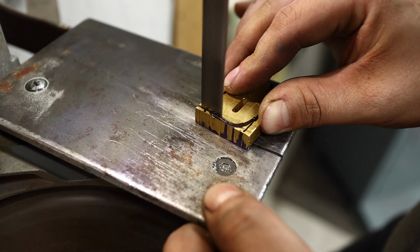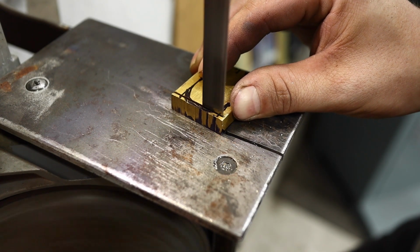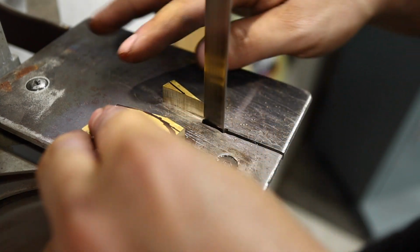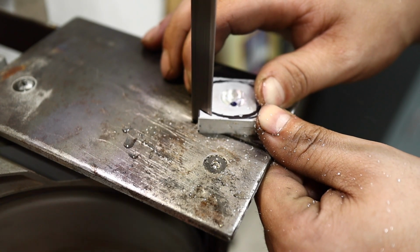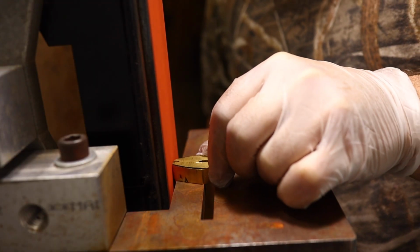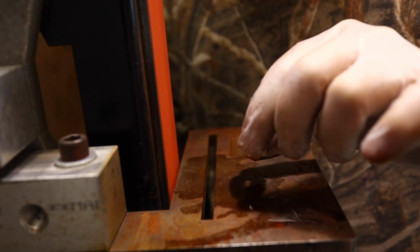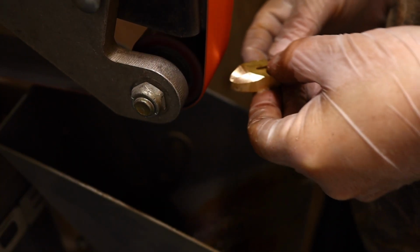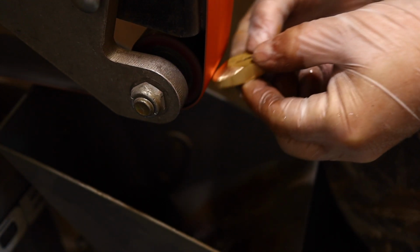Now with our blade heat treated and brought up to a satin finish, we've got to start assembling the handle. So what I'm going to do is rough down a lot of the bulk on the guard and the pommel that I've already created. Remember, we carved out those notches. If you haven't seen part one, we did that on the mill. I'm just roughing them down to size, and then I'll grind them in, get them to the nice shape, get those aesthetic lines that I want. We'll take those to a final finish and a polish before we use the leather stack, because the way you assemble these knives is a little bit different than a micarta handle, where you do the bulk of the work after.